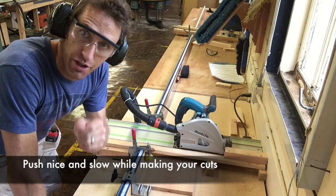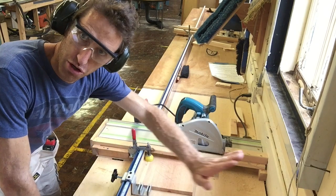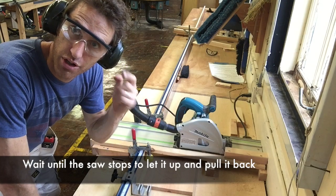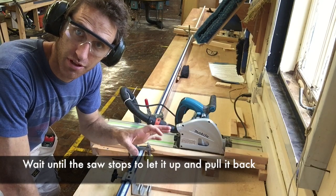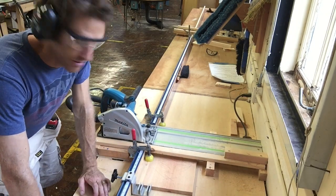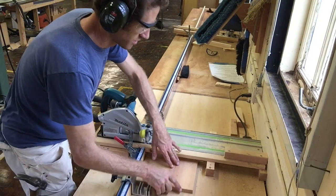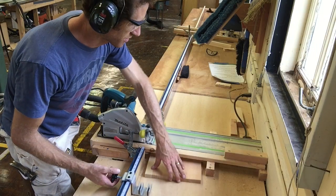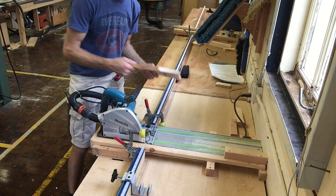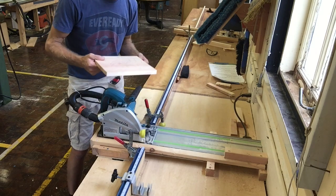Hopefully you watched and saw that I moved really slowly with the saw in order that there wouldn't be any kickout or blowout. And I didn't let the saw come up until I'd already heard the motor had stopped — come to a complete stop. Now, after that's done, go ahead and squeeze, pull it all the way back and turn it to its original spot. You can then take two hands and release that clamp. Make sure you take the straps off too — I took both my strap and this off.